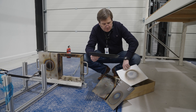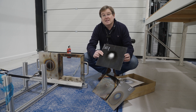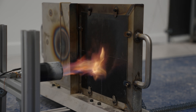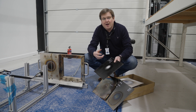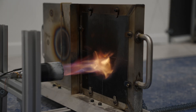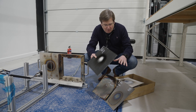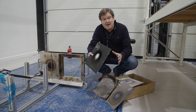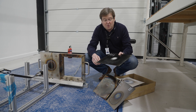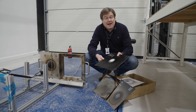An alternative approach is to create the firewall with a very specific resin system where the resin itself is fire resistant to the extent necessary. It maintains enough integrity that it just gradually pyrolises the resin and leaves you with the fibre — it loses a lot of its mechanical strength, but for a non-structural panel, as long as it holds together for long enough, that's good enough. So we have a range of options for both the firewall inside the engine bucket and the cowlings, and we can apply some of these material technologies for the final recipe for the firewall in the HX50.